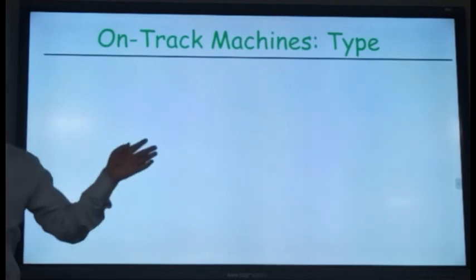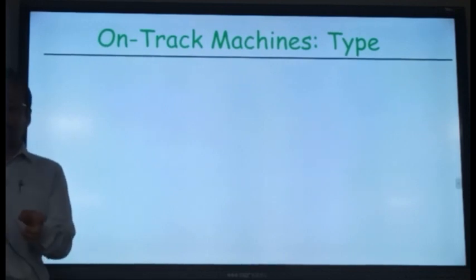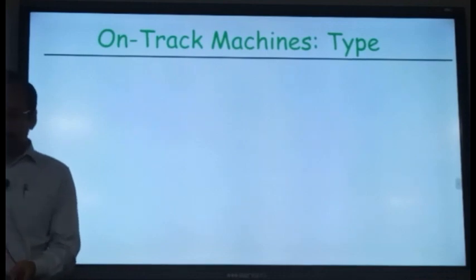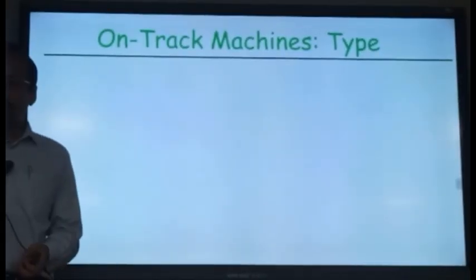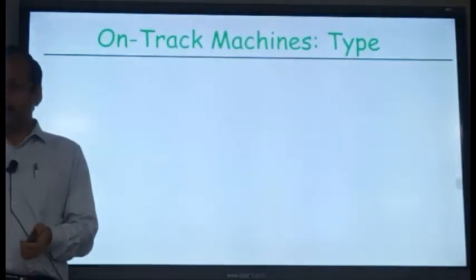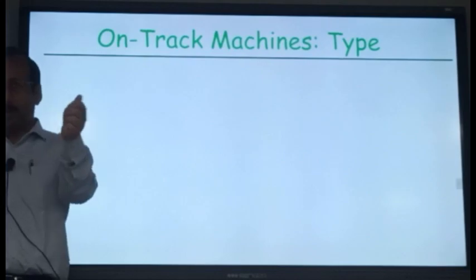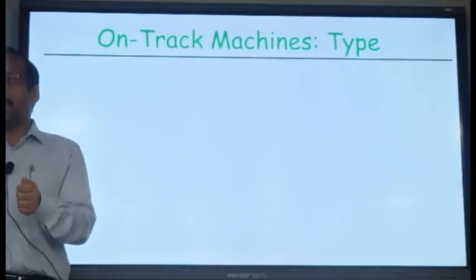But in our track, there is a curved track. Maybe curved track also it can do. There is no issue. It does all types, because the center line is marked, so it will put the sleepers with respect to the center line. There is a center line marker point that has to coincide with that chalk line. There is a remote control. You can shift the machine so that the pointer coincides with this center line. In the curve, you have to keep on shifting a little bit.